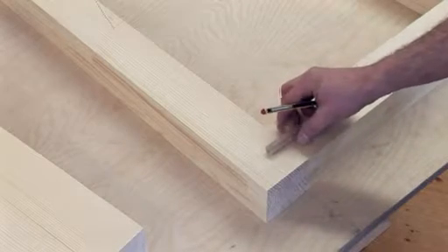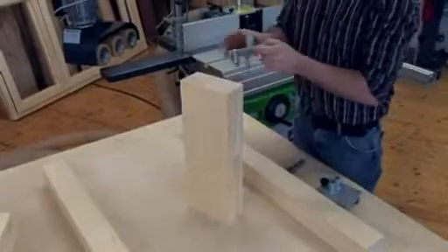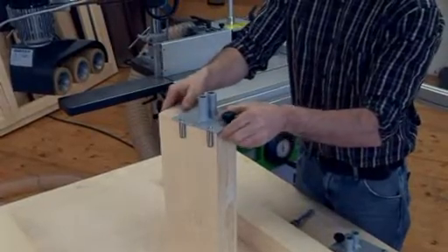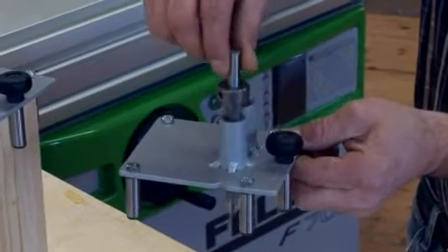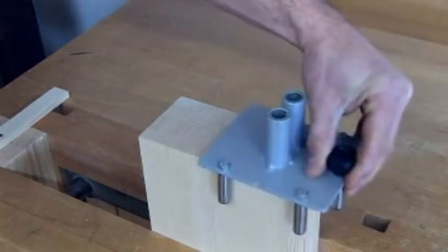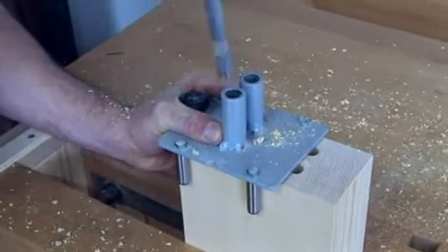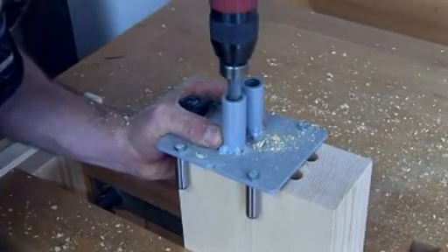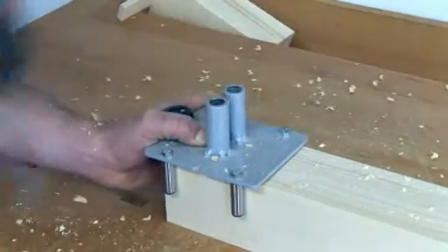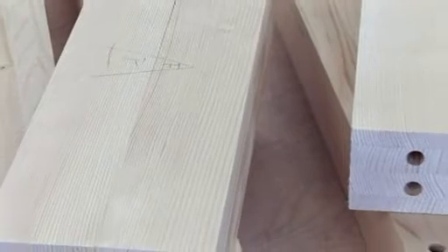The joining of the various work pieces will be strengthened by using dowels. With the optional boring jig, it allows you to make the boreholes accurately and without mistakes. Simply place the jig on the end of the work piece and the depth stops guarantee the exact boring depth. The simplicity of the system makes it practically impossible to make a mistake and allows you to accurately repeat the process over and over — dowel holes drilled to perfection.